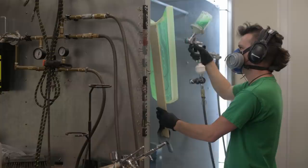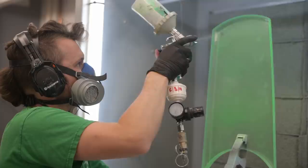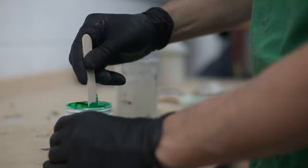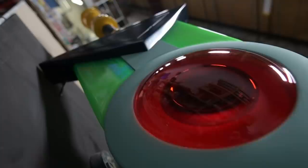For painting the blade sections, we had to mask off everything because we want the outsides to be nice and glossy. We want the insides to be flat matte so that all the light that happens on the inside of the blade stays in there and it glows really nice bright green. We mixed a matte clear coat with a UV-reactive, very vibrant dye and then sprayed several layers onto the interior of each of the blade segments until we had just the bright shade of green that we were after.